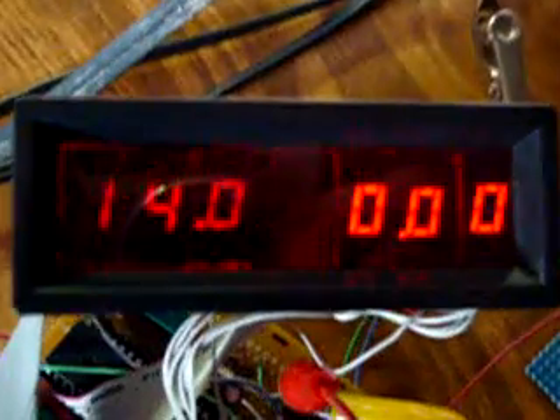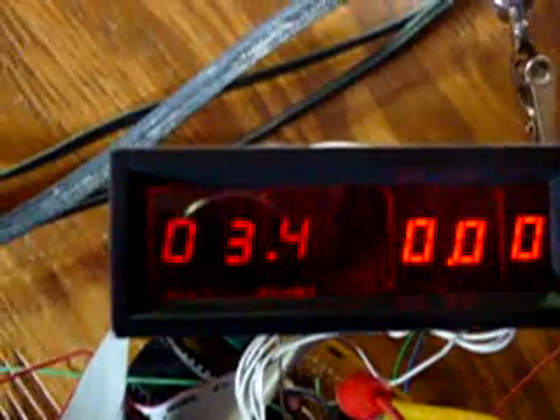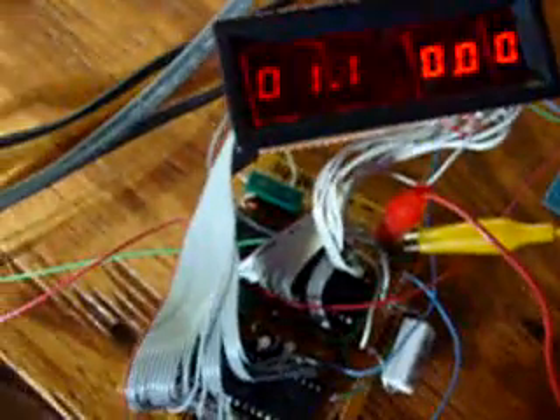The bezel makes it show up a lot better too. The first one is the volts, and if I put a load on it there'll be a reading for the amps. That's not accurate yet — I'm going to have to set it. I have these tiny little 40-turn trimmer potentiometers here that I managed to have among my parts.